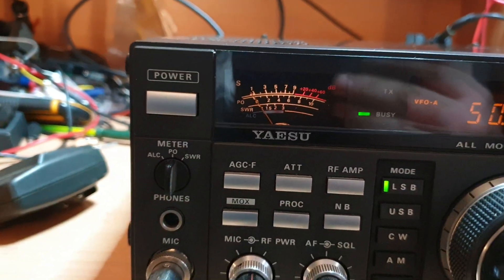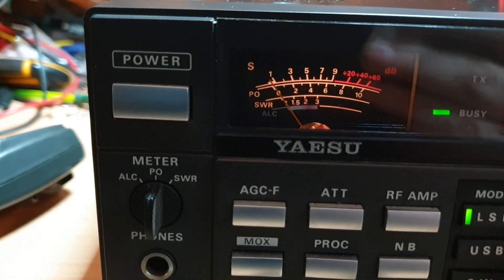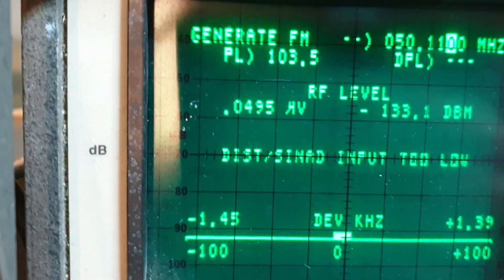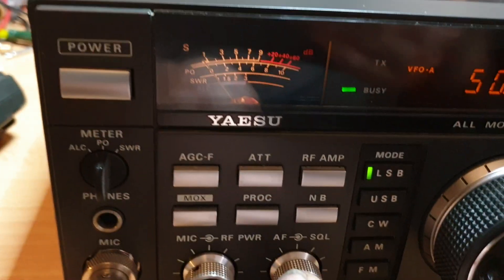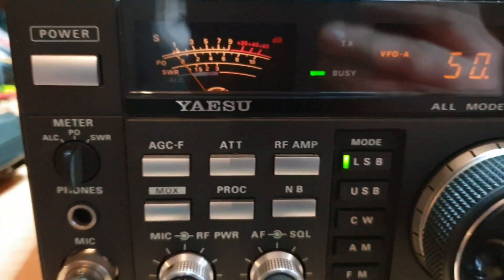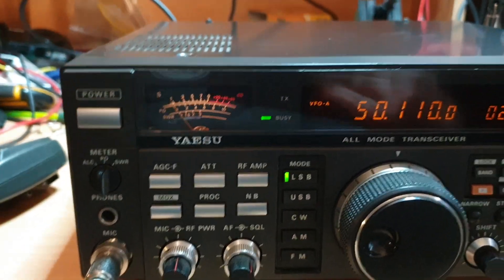So minus 123 dBm, and they really do perform well. When I go down to the next step — at 0.0495 microvolts, so minus 133 dBm — I can definitely just hear it in there, though I doubt that you will on the video. When I go back up to 0.157 again, it's such a solid signal. My point there is that this thing really does receive well, right into the noise.